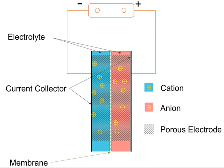The heat generation coming from current loads should be smaller than 5 to 10 K at maximum ambient temperature, which has only minor influence on expected lifetime. For that reason, the specified charge and discharge currents for frequent cycling are determined by internal resistance. The specified cycle parameters under maximal conditions include charge and discharge current, pulse duration and frequency. They are specified for a defined temperature range and over the full voltage range for a defined lifetime.